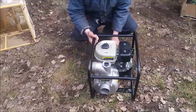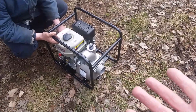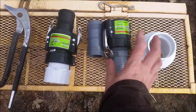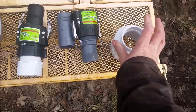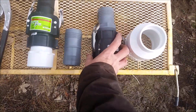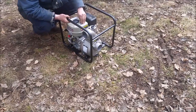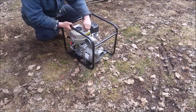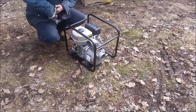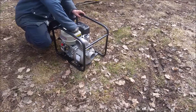So we picked up some fittings here. It comes with just your basic fittings — barbed for 3-inch — so we need to reduce this down to 2-inch. Tractor Supply and Menards both have these gator locks. We picked up a 3-inch to 2-inch PVC reducer, gator locks for the hoses, and some brand new flexible hose. 25 feet for each end. I don't want to restrict the flow of the water too much, so 2-inch is plenty of a reduction.